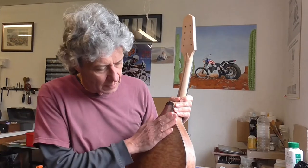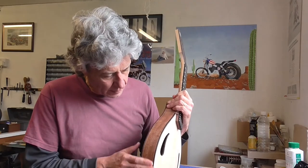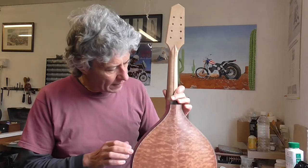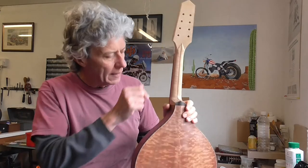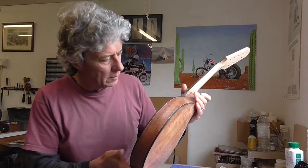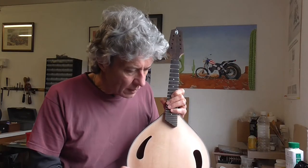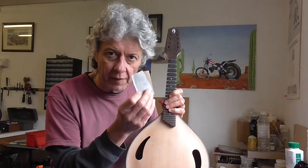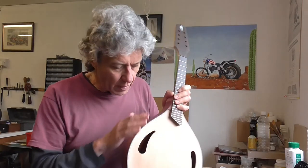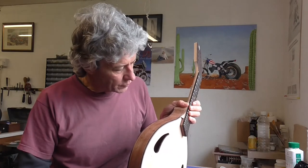Well that took a lot longer than I anticipated. I said it would take about an hour and a half — I think I've spent more like four hours sanding down the backs and sides to get rid of all that epoxy, and then cleaning up the neck, head overlay, and giving the top plate a good sand, all using 500 silicon carbide paper. So the whole thing is clean now and the grain is filled, ready to start French polishing.